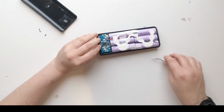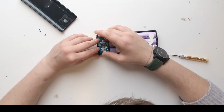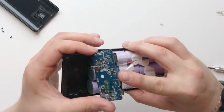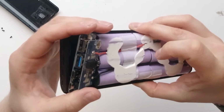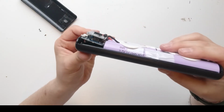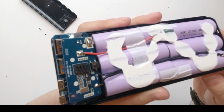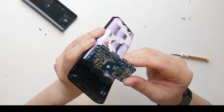I was surprised too when I opened it up just now. What they've actually done is connect 2 batteries up in series to produce a total of 8.4 volts when it's fully charged. That's 4.2 volts each because they're lithium-ion cells. And then the chip on the PCB raises that voltage to 9 volts, 15 volts, or 20 volts, or whatever it feels the device needs to work. That's simple and clever because there won't be as much thermal loss, and the efficiency of the voltage being raised is increased because they have used 8.4 volts rather than 4.2 volts.